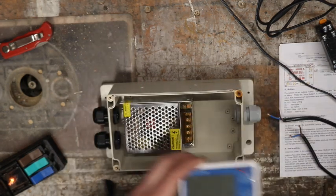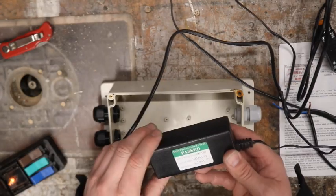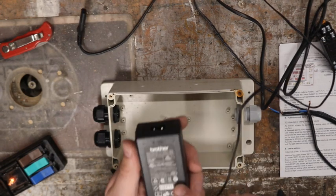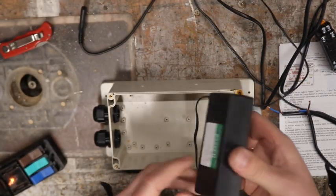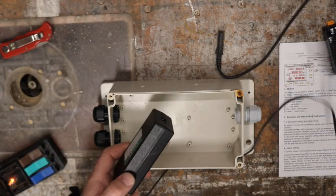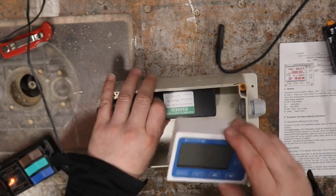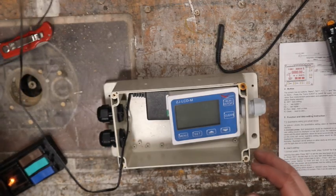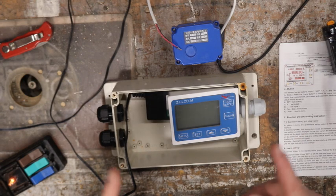I've been rooting around my box of spares and I've come across a power transformer - it looks like it's from a printer, a Brother transformer - and the output is actually 24 volts DC, which is quite convenient. I'm going to split it open, take out the PSU on the inside, and solder it into position. We need to put a 24 volt power supply in there to run the water meter, and looking at it, it's all going to fit nicely. We're not going to use a solenoid - we're going to use a rotary valve driven by 12 volts DC, opened and closed by changing the polarity of the 12 volt input signal.